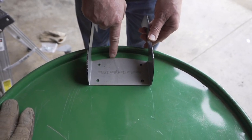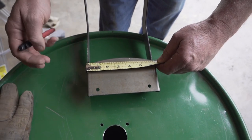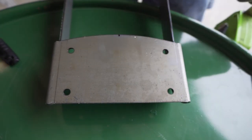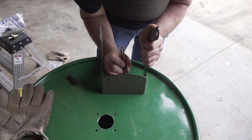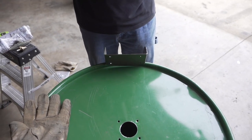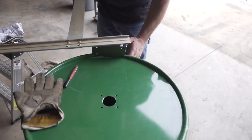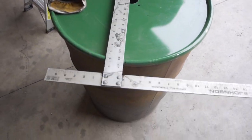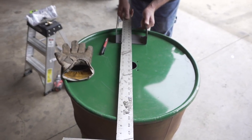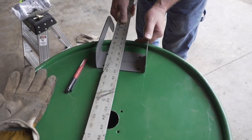The one thing we want to do is get it centered so it doesn't look cocked when we put it on. I take this and measure it and mark the center — let's flip it over. Just take your tape measure — it's about six and three-eighths typically, so we're going to make a mark at three and three-sixteenths. Then carry that mark over to the other side. Now it's as easy as lining that up. I do this so much I can eyeball it, but if you want to be sure, set it back up on your marks, get your handle positioned, sight down the side of the ruler, and you can see the black mark we made on the handle. Dead on.